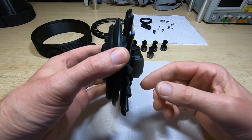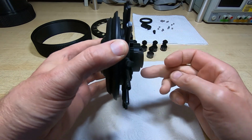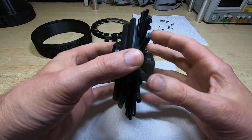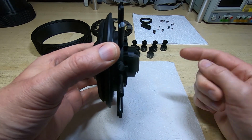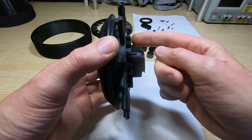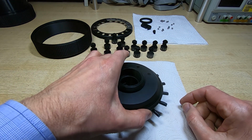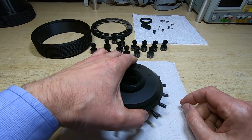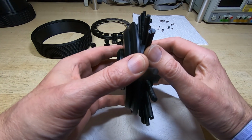So it turned reasonably well, quite stiff, until it hit one of the two stop detents, but then I had to put a lot of force in to get it to carry on turning, and the pin on the plunger wouldn't come out of the little dimples that are there. So I wanted to address those things. I've now got it working much better, so it will come out.